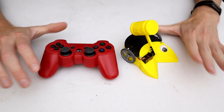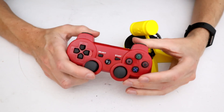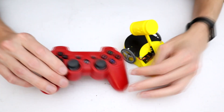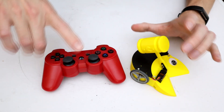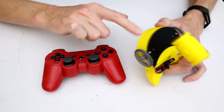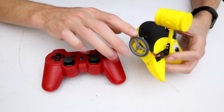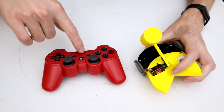When I first conceived of this Demo Bot idea, the original plan was to use these cheap knock-off PS3 controllers and basically have the ESP32 that is in these robots talk directly to these. However, there was one small hitch: the smaller version of the ESP32 that I'm running in these, to shrink the size down and make these kind of viable, does not talk to these controllers.